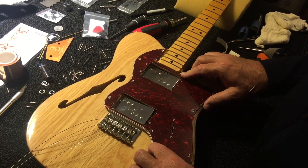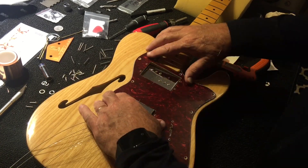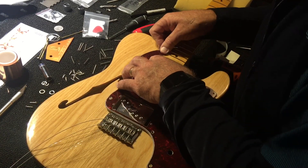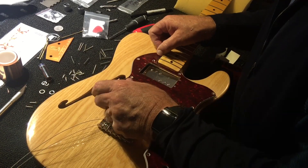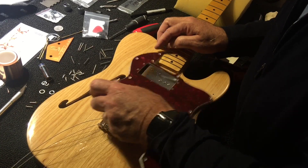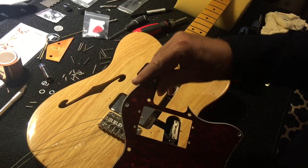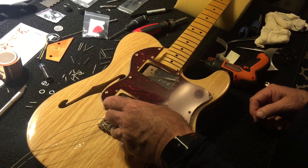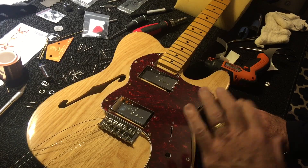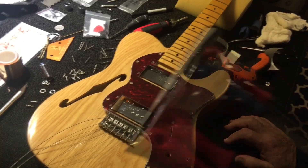This is going to sit down on there, but I've got to get through that hole to make it sit down for the test. This is looking like it's going to be too tight, so I may have to get a file and file these edges. I've got a flat file out in the other room — you'll want to have that ready before you get all the screws in and then figure out that it doesn't fit.